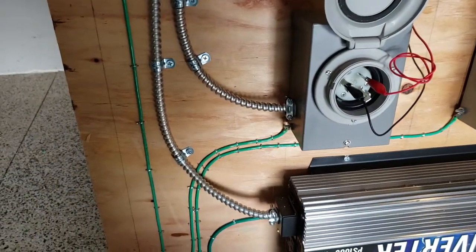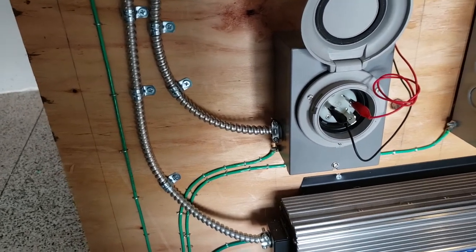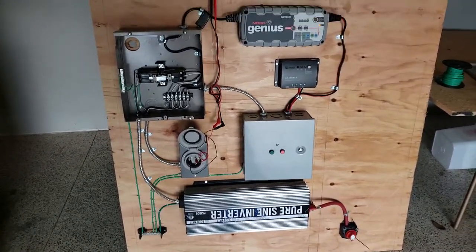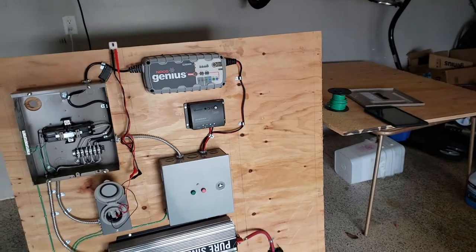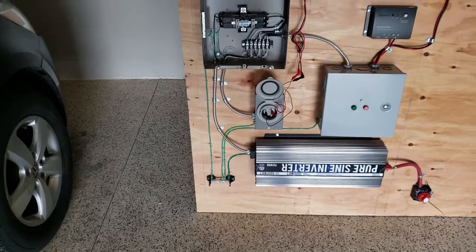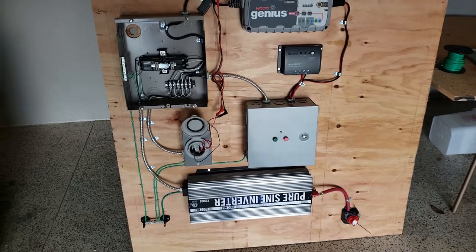The same thing goes for the generator, so it's acting as though it's an RV or a boat. We're never in a situation where we need to bond our neutral and ground. I'm trying to figure out if I can do that without hurting any of the equipment. I'm going to put a ground rod in the ground at the house, and also a ground rod out here at the shed panel, and bond all the chassis to a safety ground. I don't know that the two ground rods will create any kind of electrical loop, but I'm trying to do the best I can with what I'm given.